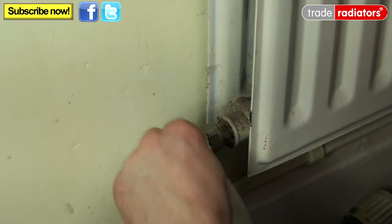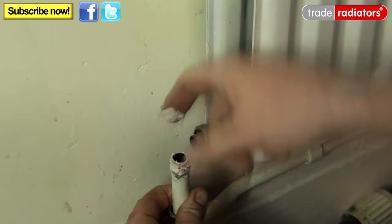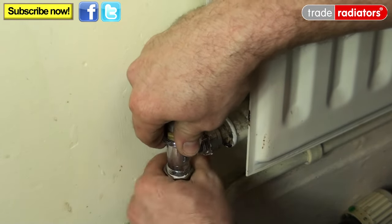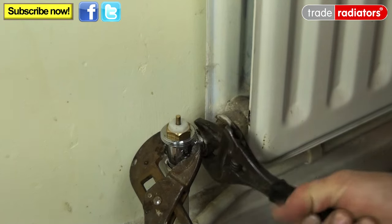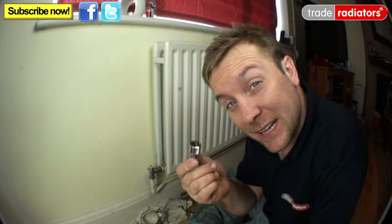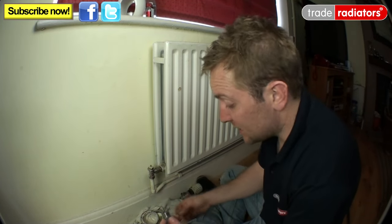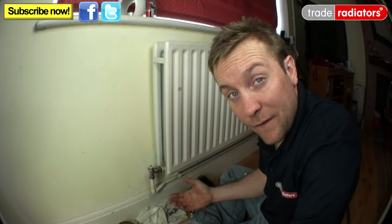Use your cloth to clean these joints off. It often helps to grab a little bit of jointing compound and smother that round the two olives that are still here, and also run that round the inside of your new valve. Pop these back on here and re-tighten up your joints. We're aiming this video at basic entry-level DIY plumbing, but if you were doing a lot more, you'd whip out the insert, pop some PTFE round your new insert and put that in, and also take off the olive from the pipe and redo that so you'd have two new nuts. But this is the quickest and easiest way for a DIYer to upgrade their system.